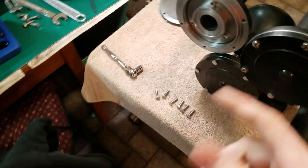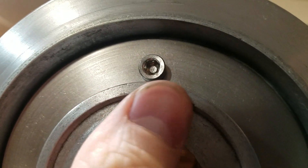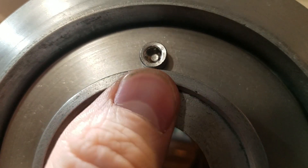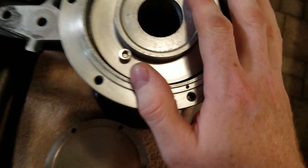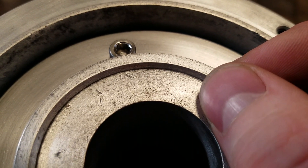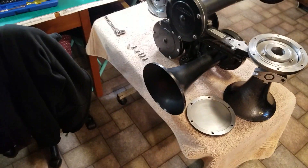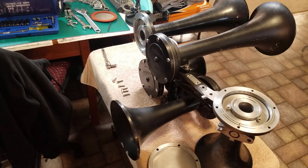That's why I really had to start taking this one apart and see how bad the nozzles were. The number one bell on that other horn also has some wear on it. You can see that angled cut right where the bore meets the nozzle — that's been worn into. Sorry about that, I had a cat being annoying. Anyway, on the number three it's really noticeable — whatever the height of the nozzle is, it's probably about half of what it should be on that other horn.